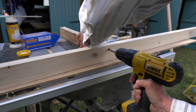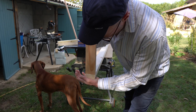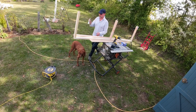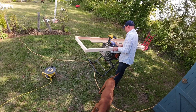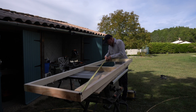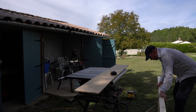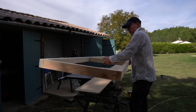I'm also using a couple of screws to clamp the frame together while the glue dries. Before the glue does dry, ensure the frame is square by measuring the diagonals. If you find it not to be square, it's just a case of moving the frame around along its diagonal until both diagonals are exactly the same.